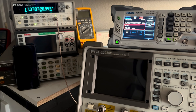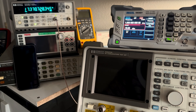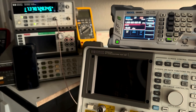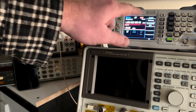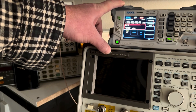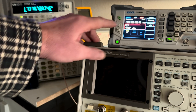After running it on the bench for a while, I installed it. I also did some other work on the 920A today. Here's a quick cold start — this has been off all night. I've got my signal generator here with an external reference, which is a pair of GPS disciplined oscillators. So this reference is going to be very accurate. Levels are minus 10 dBm at 1 GHz. I'm going to fire this up from cold.